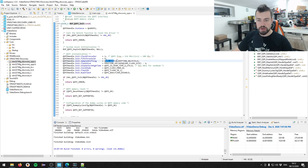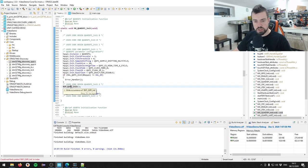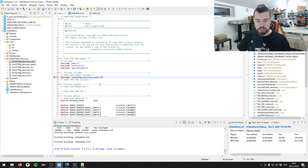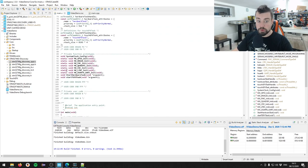We can't navigate to the QSPI function because we haven't included the header. In our main, we'll write an include and hit Ctrl+Space to find the STM32 QSPI header - insert it like this. Let's try to build. We want to include QSPI because CubeMX only configures the hardware interface, not the firmware configuration we obviously need.